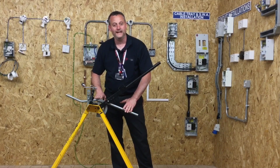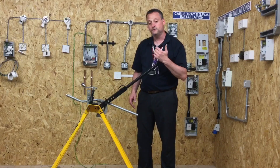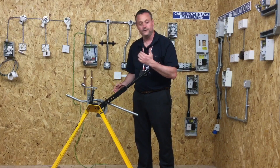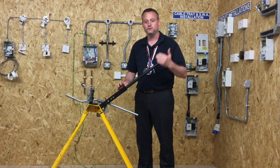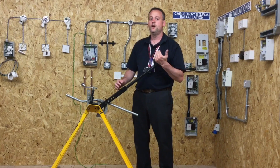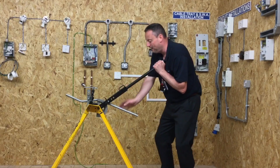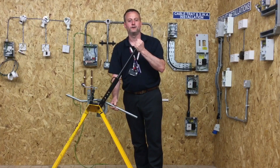It needed a little bit more bend putting in. When I get to the stage where it's only a small amount of bend to go, I say to students: the weight of your arm — you're almost not going to feel it — just get a tiny bit of bend in it. It's better to keep doing a couple of journeys backwards and forwards to check you've got it in, rather than overbend it and then struggle to pull the bend back out. So I'm just going to put a tiny bit more in, then we'll stop and have a look at where that leaves us.